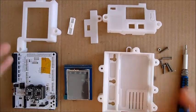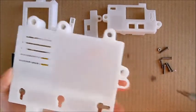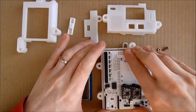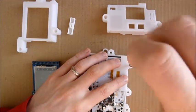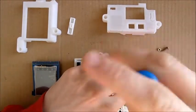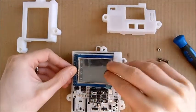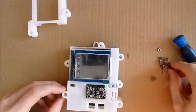We're going to be assembling the PoloGraph SD brain box. These are all the parts - six bolts and six nuts, most already pushed into these little holes. I use an Allen key to do that because it's a fairly tight fit. The board just slips in there, one of these holds it in, and then one goes on top to support the LCD. The next part goes on the front, slides under here, with a couple of screws either side.